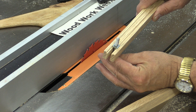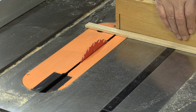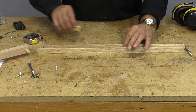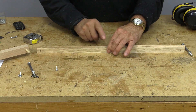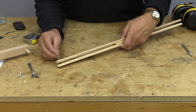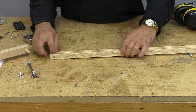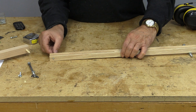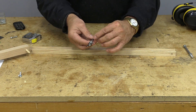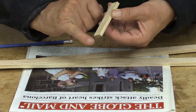There's that rabbet cut and you can see how that bolt head just fits nicely in there. Now the next thing I need to do is cut the two strips. These strips can be any width but I'm going to make mine three-eighths of an inch — that makes them a little bit more stable. I'm using one of my measuring bars to do that. Because I know these are quarter-inch bolts, I just need to cut a strip of quarter-inch wood for the center part, measuring on the inside between the fence and the saw blade.